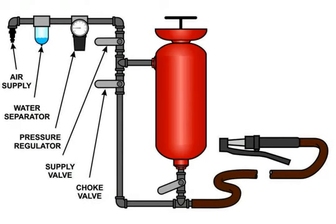There are times during very high humidity when running partially choked can help temporarily, but proper regulation through the media valve is the most efficient and proper use of a pressure pot.